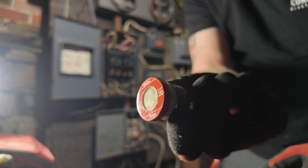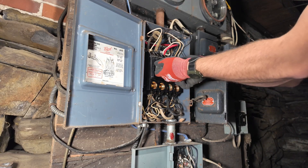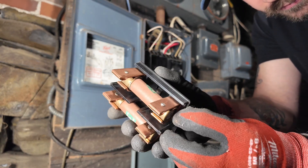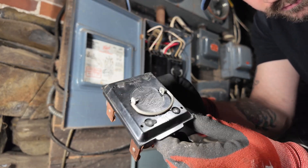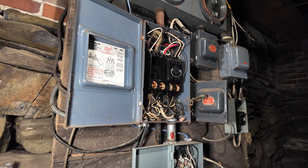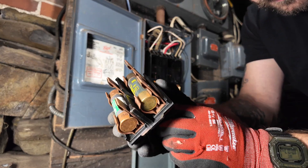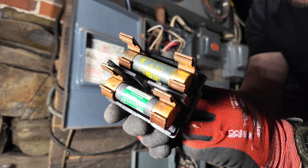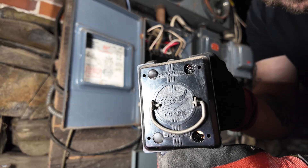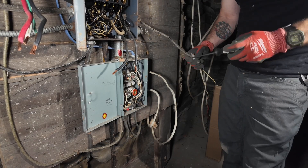I find this kind of fascinating - it was definitely a good day at work and fun to see a bit of history. There's the main fuse block right there - it simply pulls out. On the other side was the range fuse block, which both were also tapped off of for whoever added circuits. With those other disconnects on the side, I quickly realized that I had a 20-space main breaker panel that was not going to be sufficient for the amount of circuits actually here.